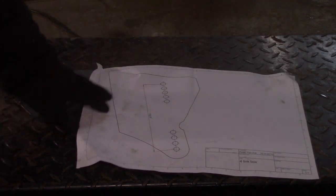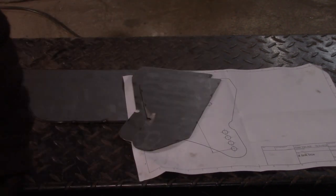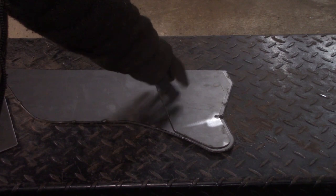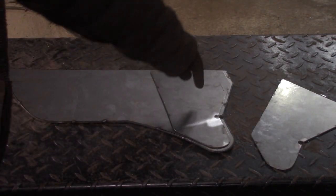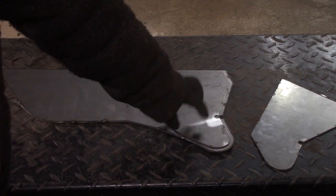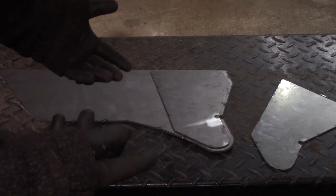These are the reinforcement plates that come right here. For me, it's another trip to the bandsaw, but for you, I already made them. So these come just right here. What we're going to do is weld them into place. Also, of course, the one on the other side. And when that's done, we're going to drill the holes that need to be in there. And after that, we're going to separate the two pieces, so we definitely know that they're the same.